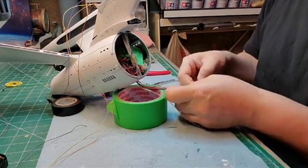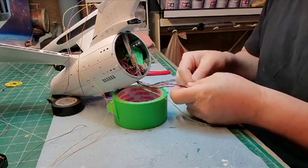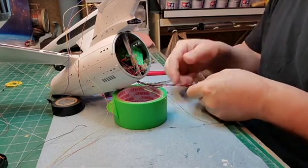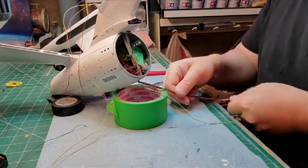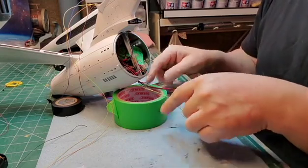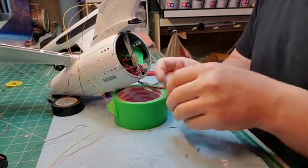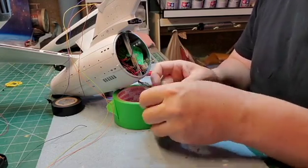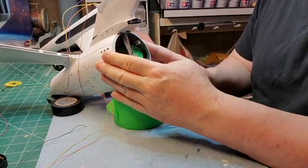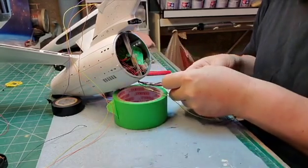Basically, that there was just a test to see how I could get the navigational lighting to work, just because there wasn't enough power going to the circuit board, which there is now. So I'm going to have a resistor on the main line inside the stand. I think I'll probably use a 100 or 180 ohm resistor, and that'll reduce the brightness of the ship a little bit, and then it'll give enough power to go to the navigational lighting circuit.